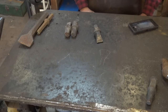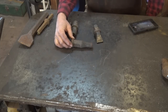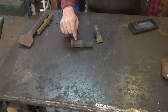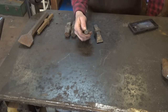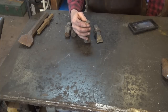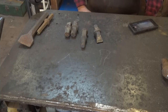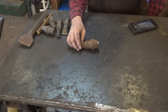Another option: this is a piece of sucker rod — the knuckle end where the threads had been — and it's about one-inch square. Different size sucker rods will have different square sections, and this would make a very small cut-off end, but it would be functional. These would also make great bottom rivet sets. I need to look into whether I can get a sucker rod with an inch-and-a-quarter end.